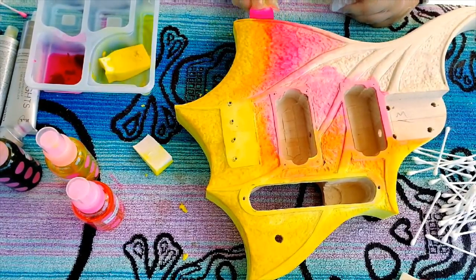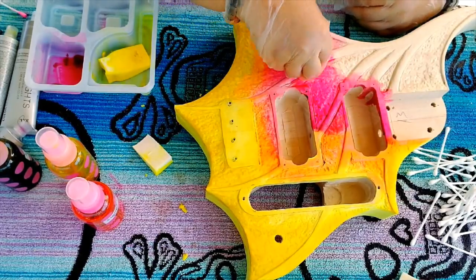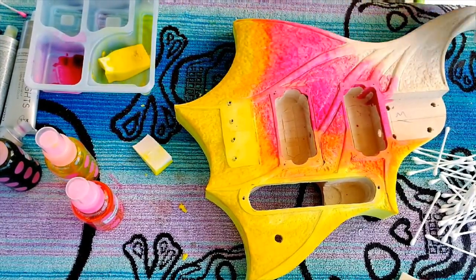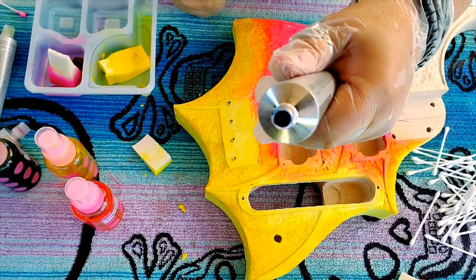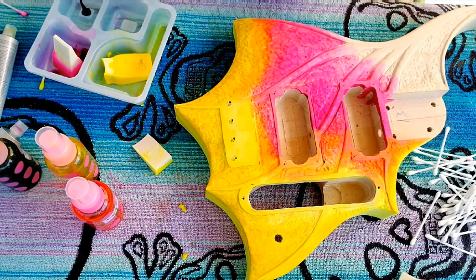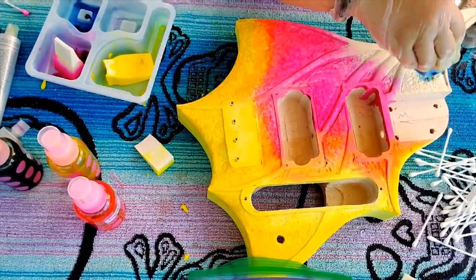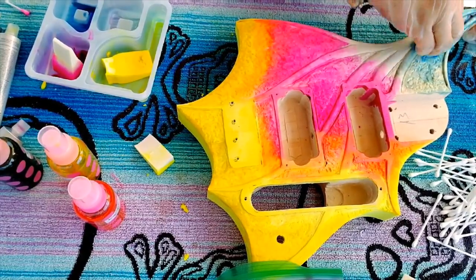What I like about using alcohol inks and alcohol-based colorants for woodworking is, number one, they penetrate deeper into the wood fibers, so you can sand back and still have some color. Also they're super duper clean, crisp, and vibrant — they don't get as muddy as water. With water it travels, but alcohol evaporates, so you wait 30 to 45 seconds and you're not going to have a problem with bleed out as much as with water-based stains. The aqua color is a lot lighter and less pigmented than the magenta, so I'm going to have to go over that several times.